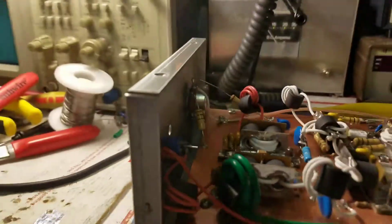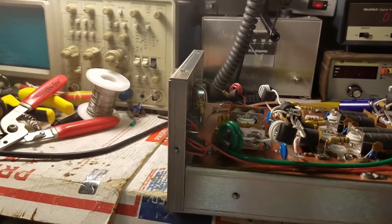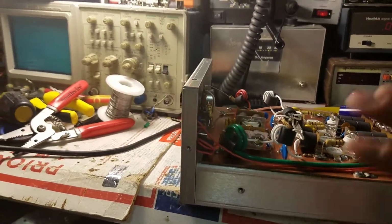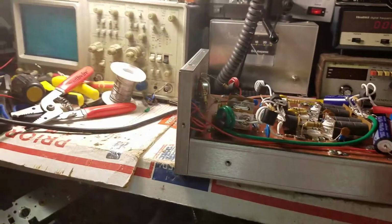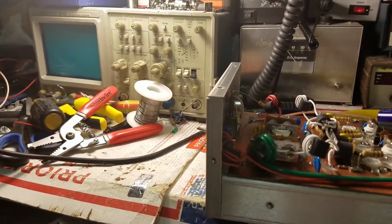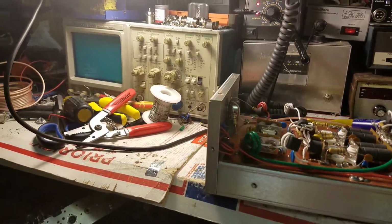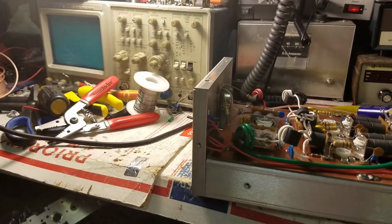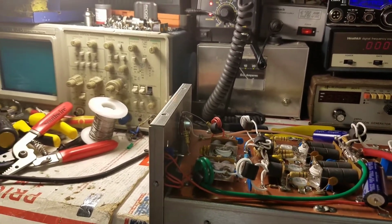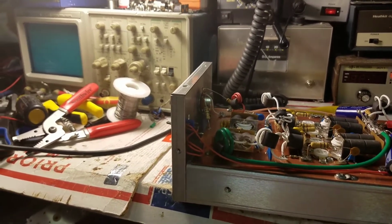There you go. We'll do another video soon on this Monday, and I'll put the meters in line on the front and behind and everywhere, and rule out anybody trying to say there's any kind of reflect issues or whatever. I promise you the reflect is zero all the way around. In fact, I turned the variable up to a 500 watt dead key a while ago. I had half a watt coming back on the dummy load. So, I mean, you know, it is what it is.